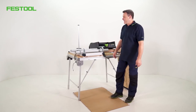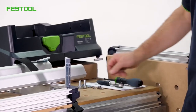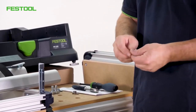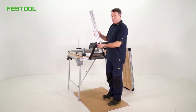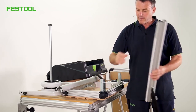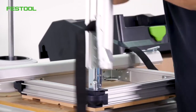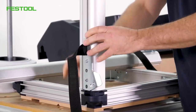The parts are all unpacked. The profiles, plate, wheels, trough and screws are all ready. We have two bolts and two metric screws for the handle. There are also four self-tapping screws which connect the trough to the base profile. I'll start with the profiles, which are fitted with a strap and a retainer. I'll mount them onto this profile. Before inserting the profile, I need to loosen these four allen screws. Then I'll tighten the screws.